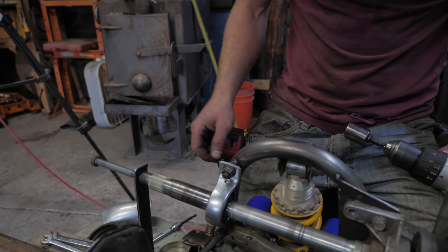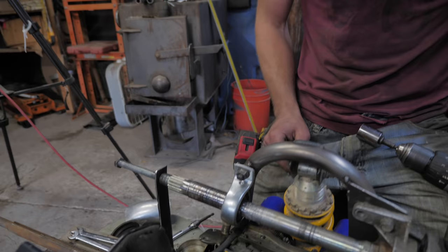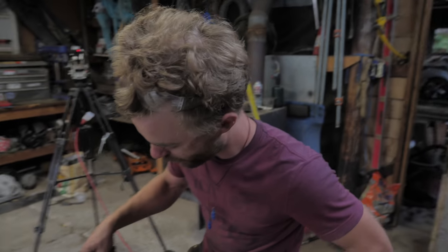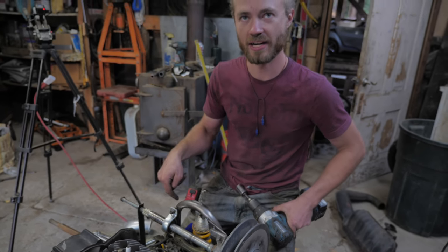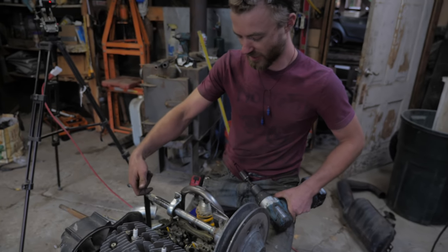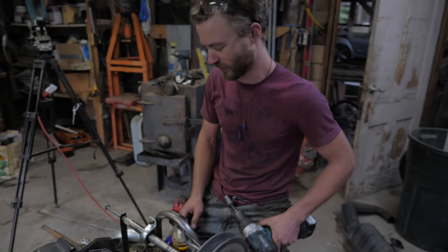Well, it looks super straight. Yeah, it wobbles a little bit, but interestingly, just a little bit. That's actually less than it did to start with. It was bent when I started with it, and that's less wobble than it had. And the cool thing is, because I ground it right there for the carrier bearing, where it goes through the bearing, it's perfectly straight. It doesn't wobble inside the bearing at all. It wobbles at the end and right in here, but it doesn't put too much wobble on the bearings. But it was bent before, so it can't be too much of a problem.